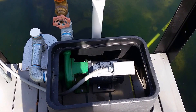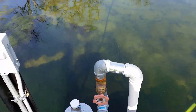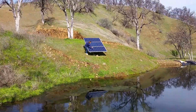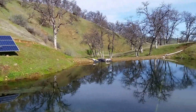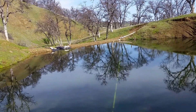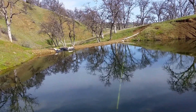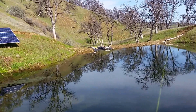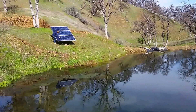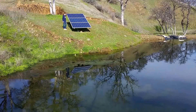You can see that clouding or shade is really a big blocker, but with this system I have more power than I really need going to it, which alleviates some of the strain. I typically over-panel projects like this because I want to get as much as I can. I'm trying to keep as much water flowing from my pond to save it. The next step is to put some batteries with a charge controller so I can pump this thing 24 hours a day.